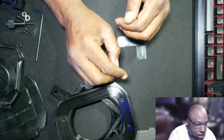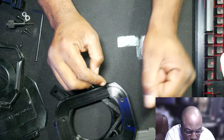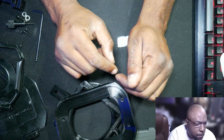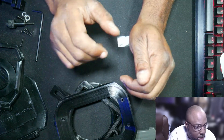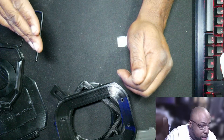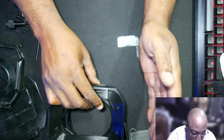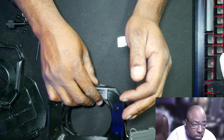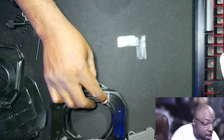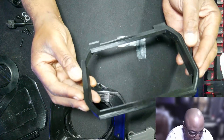That shininess is because I stopped using glue sticks and started using this other stuff — I'll put a link to it in the description. It's called Bed Weld. It looks like shoe polish — you just spread it out, heat your bed up, and you're good to go. It's excellent. It gives it a mirror finish, it's real sticky while it's hot so it keeps your parts on the bed, and when it cools off you can just pick it right up with no issue. I'll put a link in the description.